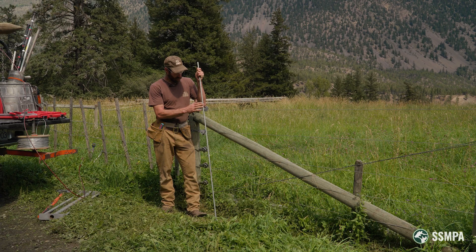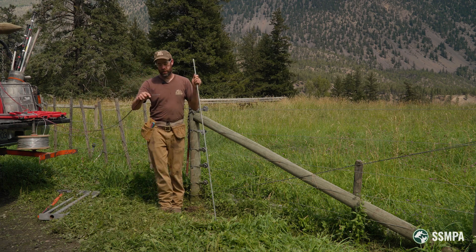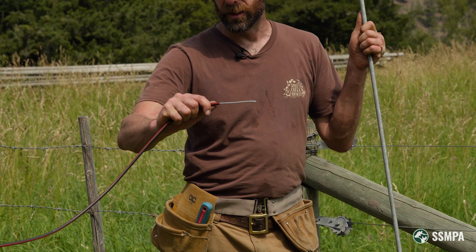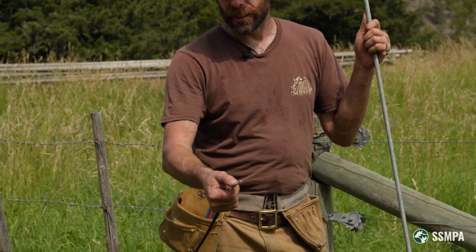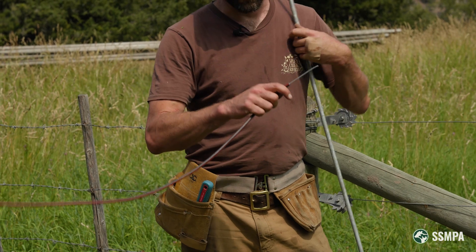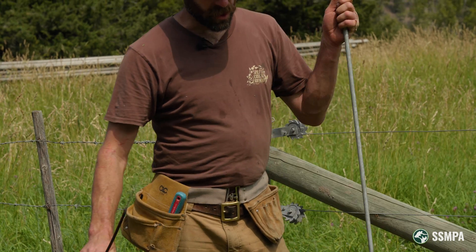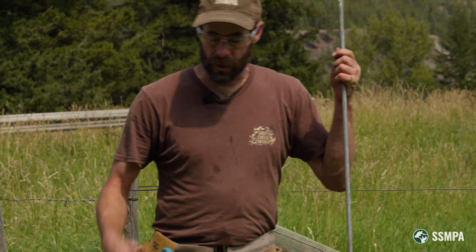You should hook it up with an insulated hookup wire that should also be galvanized — twelve and a half gauge galvanized steel. In this case, this is aluminum-coated galvanized wire, so it's extra conductive, and these types of insulated electric fence wire are a great choice for hooking up your ground rods. As soon as you're using something like household electrical wire in an electric fencing system, a lot of people think about the size of the wire in terms of how much current it can carry — a 12/2 household wire may be adequately sized to carry the current.